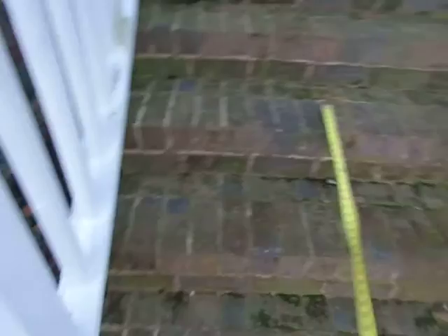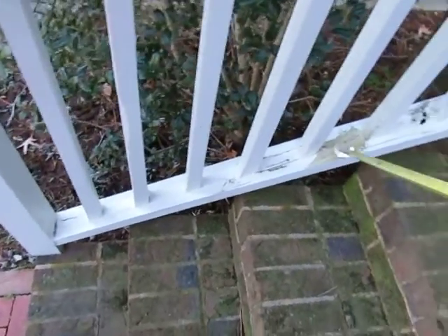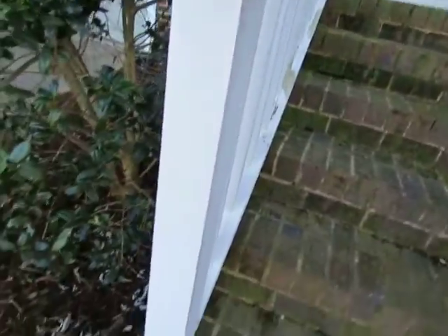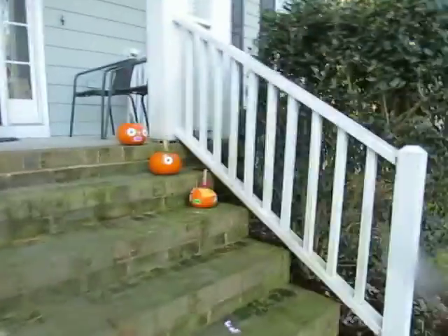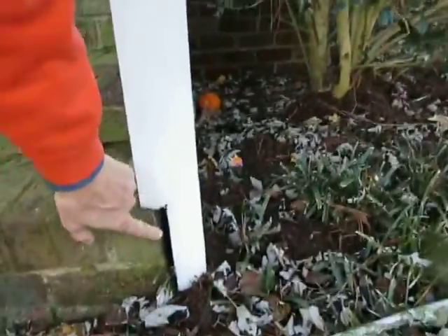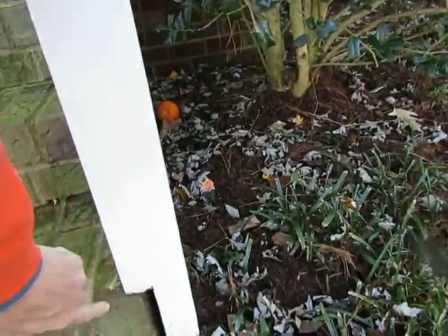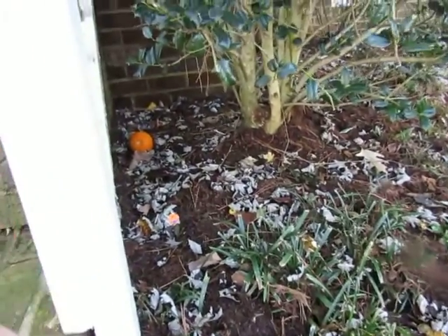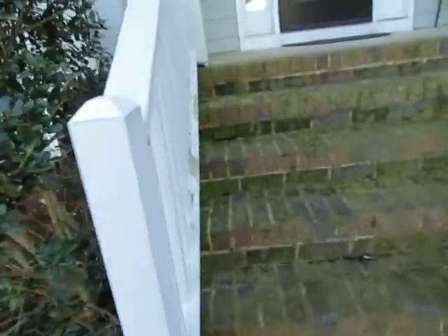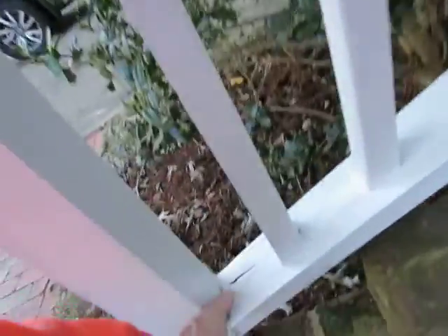This point is wood rot — bondo. The part I don't like from an engineering perspective is this, and squirrels are loving that. What they do is they split that four-by-four so it's an inch and three-quarters on each side — that's enough beef to hold it. We need to get some side bolts; I saw one on the other side. We bolt that in down here so it'll fall in the middle of your column without having to take off the bottom four-by-four.